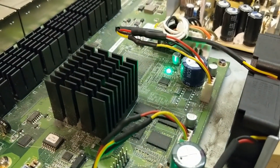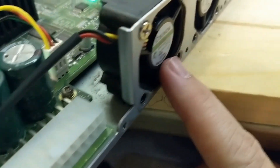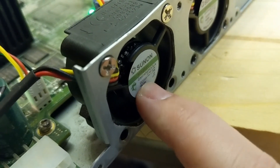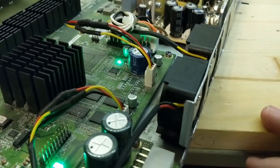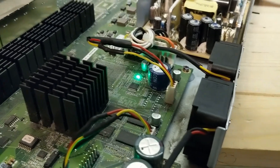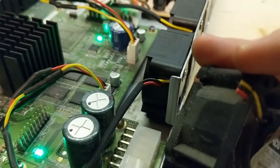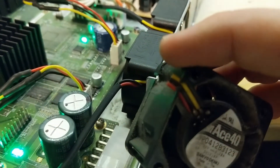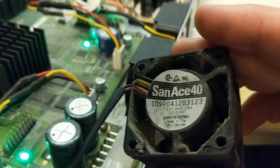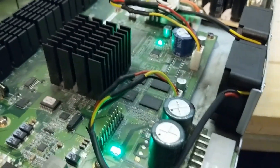And that's how you make a switch quieter — put higher voltage rated fans in. There were 12s in here, we put 24s. Quiet. You could also put a resistor in line with the fans — cut one of the wires, probably the red, and put a resistor in there. I don't have resistors but I do have spare fans, so I'll swap the fans.